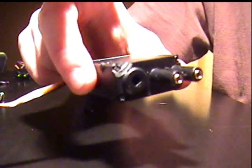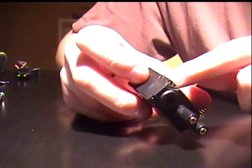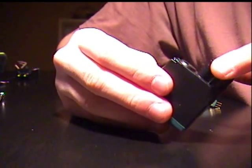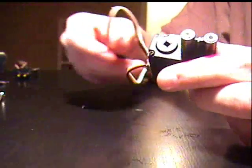If this is happening to you, you need to fix the inside part on the motor. See, I'm not even pushing any buttons. It's continuous rotation, and it won't even stop. That's because the motor on the inside doesn't think that the servo is back at the starting position, so it just keeps spinning thinking that it's going to get there. And then, once it gets to the starting position that it was at, it stops. But this is not spinning the potentiometer, so it's never going to reach that, so it just keeps spinning.